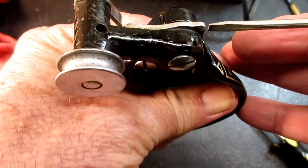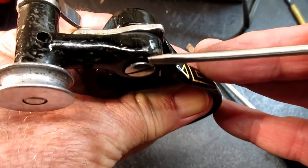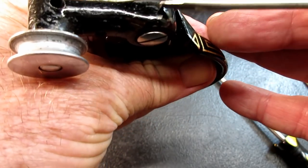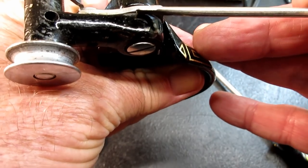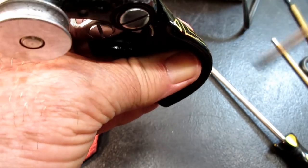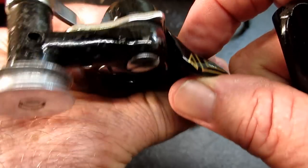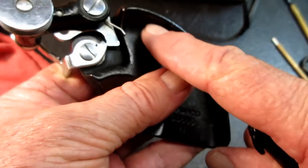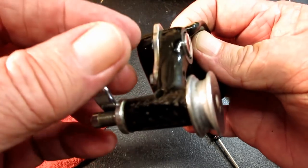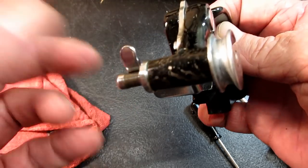Because when I look here, I can see that my screw went in all the way flush to the frame. And the frame on the winder is flush with the tripping arm. And the tripping arm on this side is flush with the bracket. So that looks really good. And my spring is under the curve up here, and my latch is above the spindle, or my spindle is below the latch.